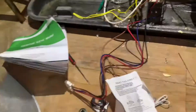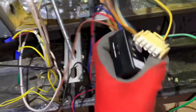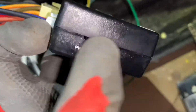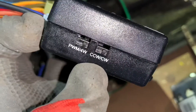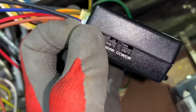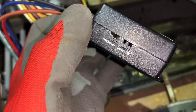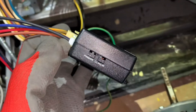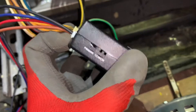Now let's move on to the module settings. There's an option for PWM or 24 volts — there's a toggle switch. The setting shown is 4W, which is still 24 volts. If you're not sure whether you have PWM or 24 volts, start with the toggle set to the 24V side. You can also change the rotation direction of the motor with a separate toggle — clockwise or counterclockwise.